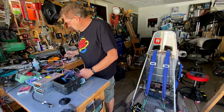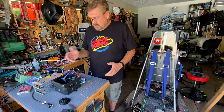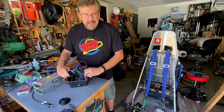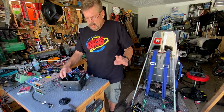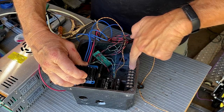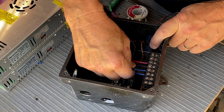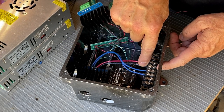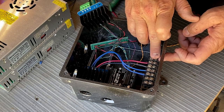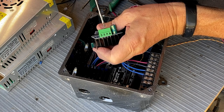One thing to note: when you start adding the big thick wires it gets a little unwieldy, so go carefully because they're going to add a lot of weight to these components. The blue wires just need to run from here right over to the panel, same with the red and black — don't make them super long. The first set of wires is done: plus and minus to motor one, and these are going to be motor two. I'll do the black wires for motor two — plus and minus to the converter. We just need to wire up the second IBT.